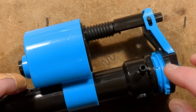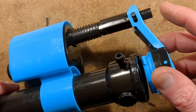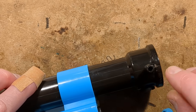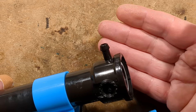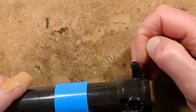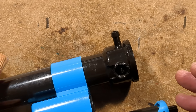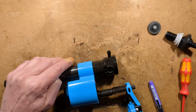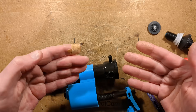There's also this feature here. I don't think it's used in the UK — I think it's for siphon toilets where a little water drizzles into the bowl as the cistern fills. It's probably blocked off normally, but during manufacture they may offer versions for siphon toilets where some water is diverted down into the bowl while it fills, likely by drilling a small hole into that cavity. I've only really come across siphon-flush toilets in America, and when I was young at the Hunter Health Centre in Iscobride — they scared me as a kid because the water looked like it was going to overflow the toilet.